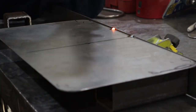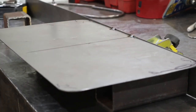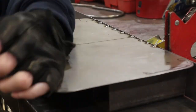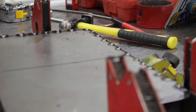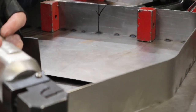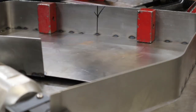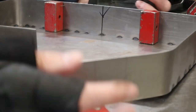After centering the flange on the back plate, I wrapped it around each side and tacked it as I went. I now tack the flange around the back side of the license plate recess. I also use my air-operated offset tool to offset one end of the flange so that when I put them together, it'll give me a nice flush joint on the inside.